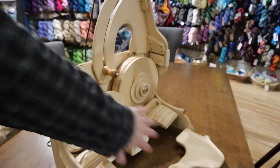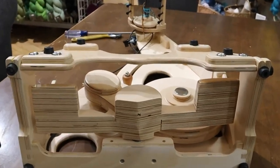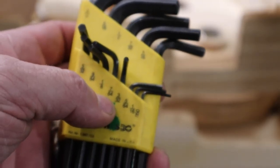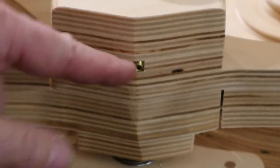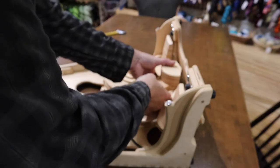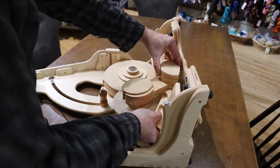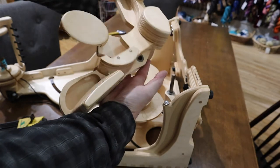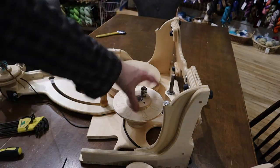Now to take all this apart, the treadle has to come off first, so we're going to lay this on its back. There's a set screw right there. I'm going to take my 3/32nds Allen wrench and loosen this screw — don't take it all the way out, just loosen it a little bit. Flip this around so it's out of your way, then open this up a little bit and wiggle it up. Now it is in two pieces that come apart — one slides onto the other, so everything is sort of interconnected here. Now that I've done that and I already have this one loosened, that slides up and out, as well as the big wheel sliding up and out.